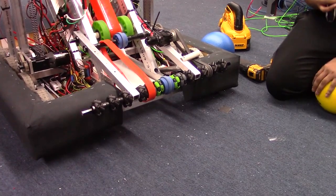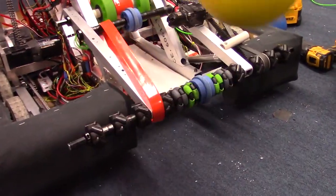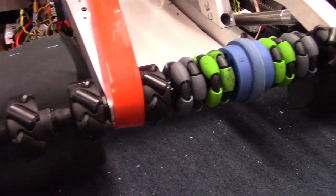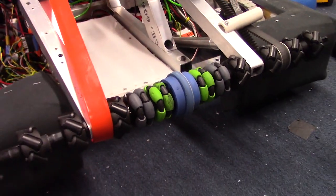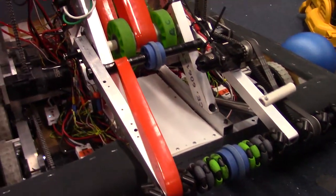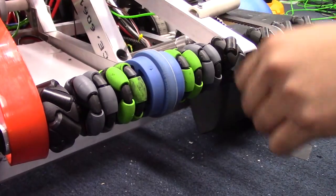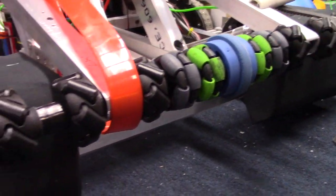So as you can see, we're still working out a couple of bugs here, but we wanted to give you guys the latest update. Unfortunately, the one bug we're working on is the poly belts. They like to ride on what we call crowned rollers — that's when the center of the roller is higher up than the outside. That actually helps them track, but we're still working out the bugs here.